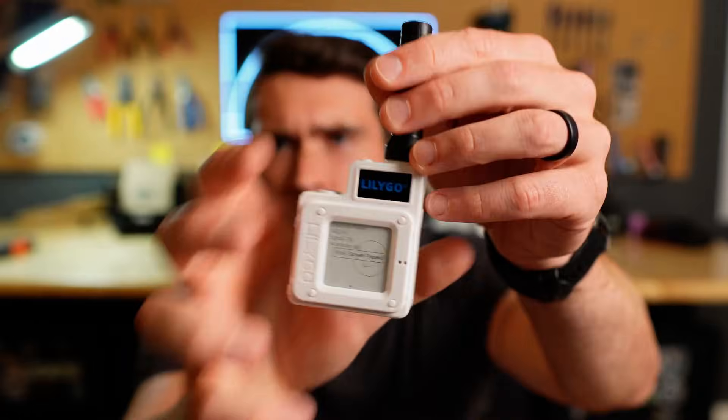If everybody's just walking around with one of these little end-user devices but there's not any built-up infrastructure, you can get messages out and have a small network, but you're never really going to have a reliable route for messages to take. By reliable I mean a fixed-site repeater specifically, because if everybody's moving around the network is always changing. A fixed infrastructural node that acts as a local repeater is the fix for that. With a repeater in one spot, that coverage doesn't change as long as it stays up. With multiple repeaters you can service an even larger area.